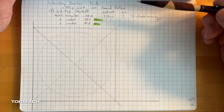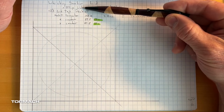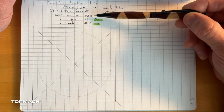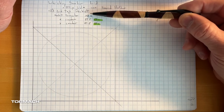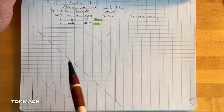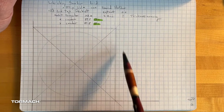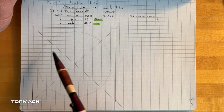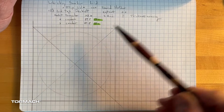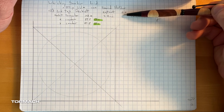All right, the last thing we need to do is flip our lid, put it into our circular holder mount, and put that onto the table. Again, we're going to work on setting this up at about a 103 or 104 pocket diameter. So we're actually just going to cut into the pocket, just because that works a lot faster than trying to cut the outside perimeter. With that, it'll just go down, and we're going to need to measure that actual thickness that is left, and that's what our Z will be.